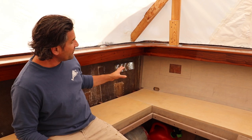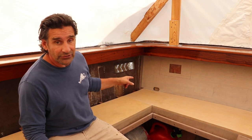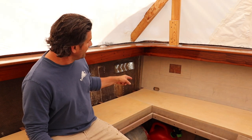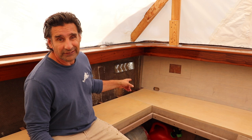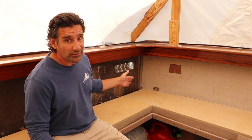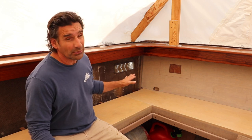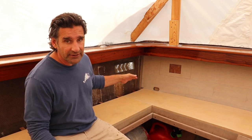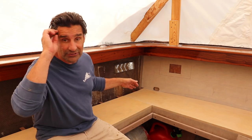So that's all sanded. Now the scupper openings we'll start with first, because I only put one layer of fiberglass on there, and I think I want to put a second layer on there. The factory only had one layer, but I feel more comfortable with two. It's all plywood end grain, but I can just zip one on there today really quickly once I'm done filming this here.